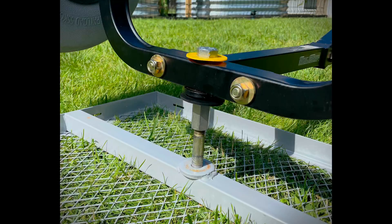One more thing — because of how big the balloon tires are, they were rubbing against the cart. So I had to raise the cart by adding a coupling nut on the original Gorilla Cart axle and passing a bolt through it. I only had to do this on the front side, since the original Razor ATV metal framing already lifted the cart in the back.